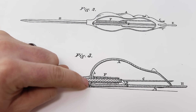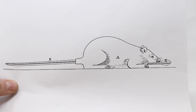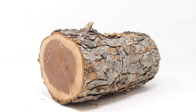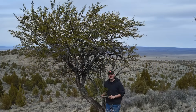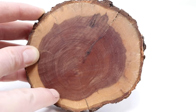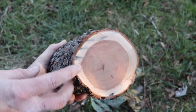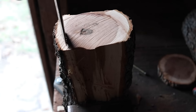There's a nice side profile and two figures showing how the trigger system works inside. There's enough detail to make a working model, so let's go to the shop and start building. We'll start by carving the mouse-shaped body for this trap from wood. For this project, I'm going to use the best material I have — a very dense, slow-growing tree I collected in the deserts of south-central Oregon, known as mountain mahogany. It's ideal for carving because the growth rings are so close together. This branch represents over 75 years of growth. To make the wooden blank for our trap, we're first going to have to remove the bark and white wood. To do this, I'm going to use a chisel.